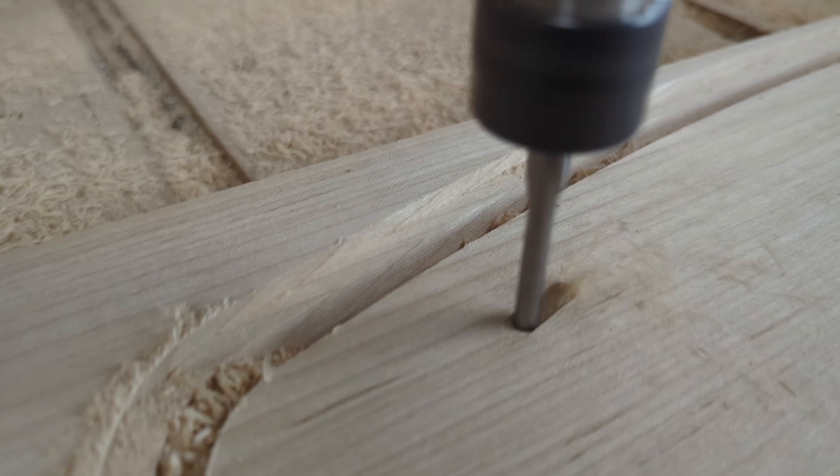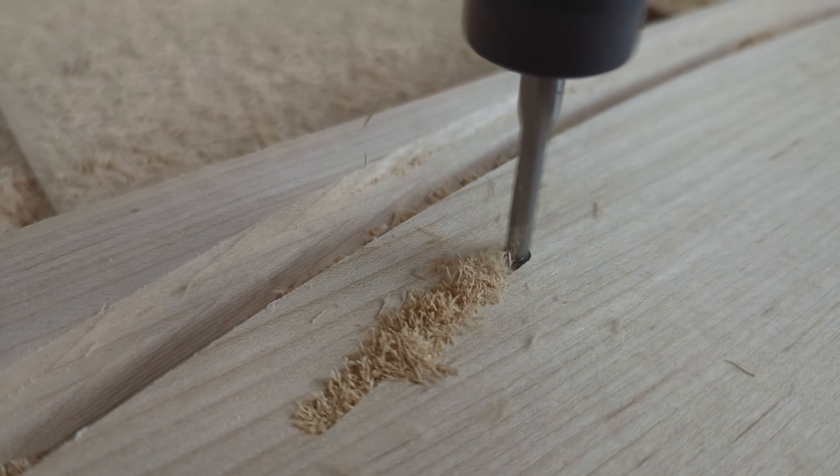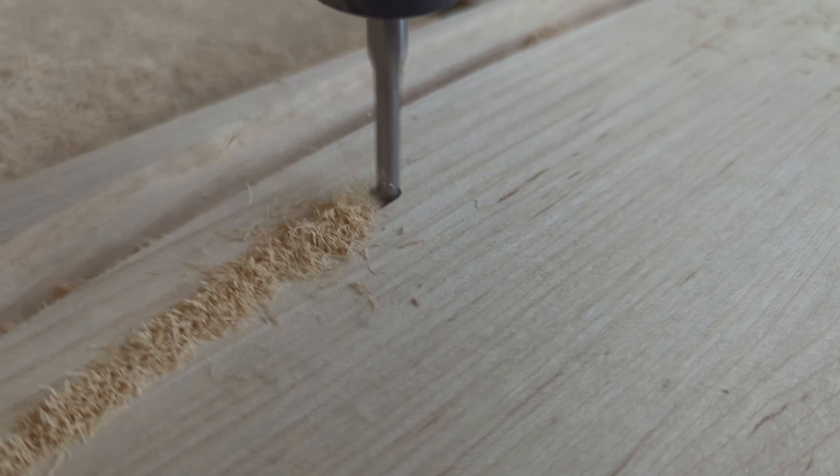The other case in point with never using bits with guide bearings on your CNC router is that your CNC makes moves in the downward direction and it may be trying to cut in the downward direction. The bottom of that bit has a physical area that cannot cut, so the machine is just going to put all kinds of force on that bit and on the project and it's going to stall out. Always stay away from bits with guide bearings — that's number one. Now let's get on to rule number two.